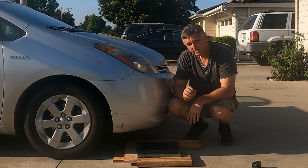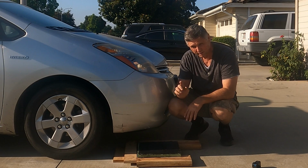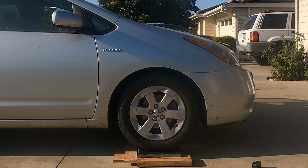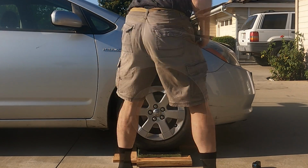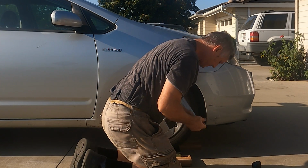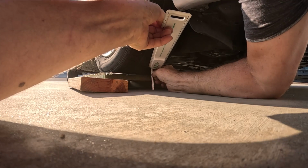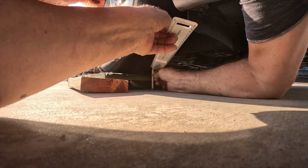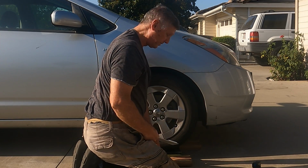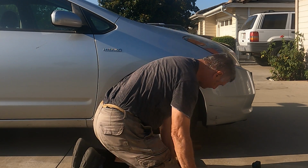But we're going to try it both with the one that's identical and the one that we built into our actual hull, which we'll do as a third test here. Okay, this one didn't break either. But how much flex do we have? It's precisely at 4 millimeters, so this is flexing much less than the fiberglass is.